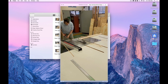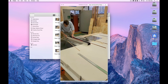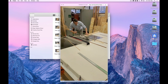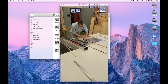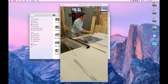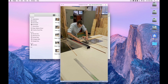Now we need to make multiples. I bring in the miter guard, set the dimension for the distance I need. But I want to make sure that this one edge is actually correct. I switched the position of the guard and I will just trim off this one end, because now I have three edges that are perfectly 90 degrees. Then by using both guards — the rip fence and the miter guard — I can quickly cut the four parts she needs, and they're all exactly to the same dimension.